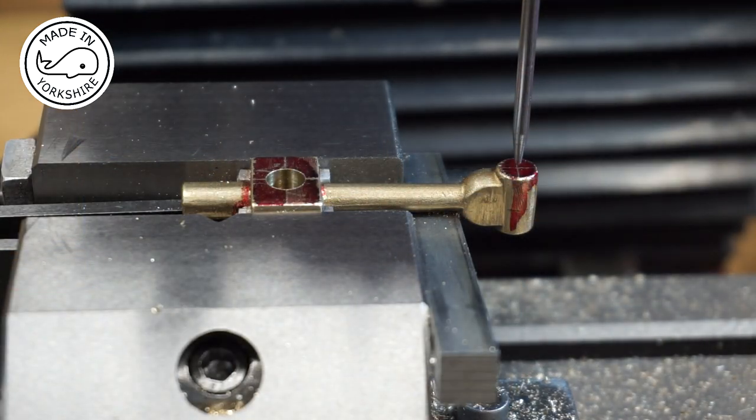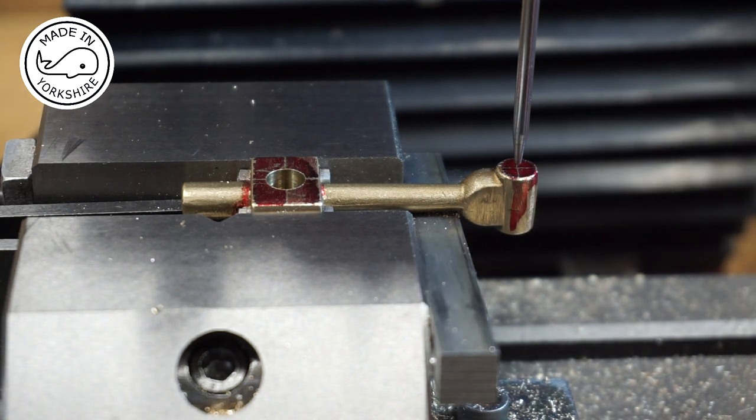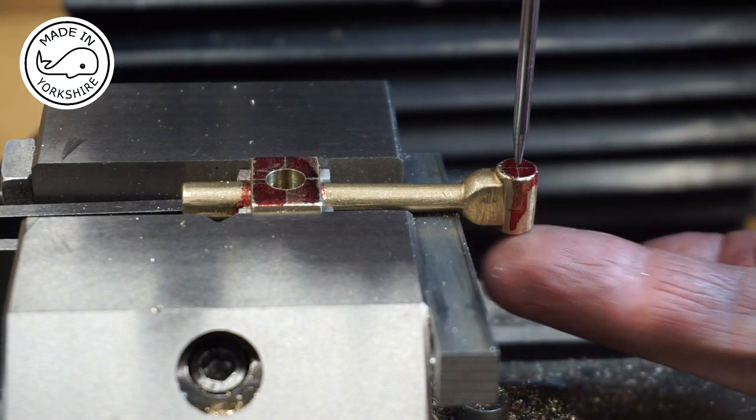Well, the big end seems to have worked okay, and I've just moved the x-axis 1 and 11 sixteenths of an inch, which is equivalent to 42.86, so I've used the dial to move it across, and this little wiggler is spot on. Now I know the brass is out of shape, but I'm just going to carry on based upon the dimensions and the markings I've got here, and we'll just see what the result looks like